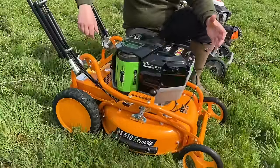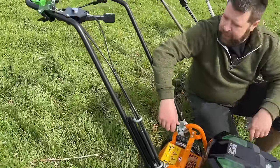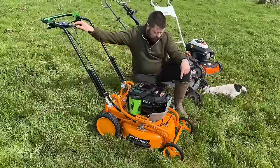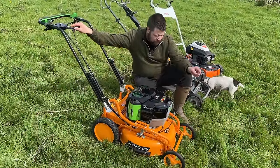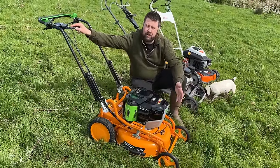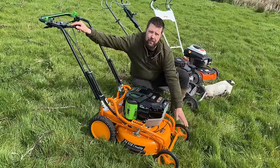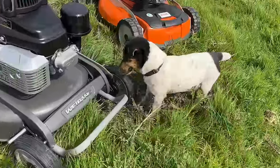The Grin has a very special blade protection system underneath, mounted on a cone with no bearings. It's fully supported so if you hit anything, there's a little bit of movement between the blade boss and the cone itself, so you're not going to damage any bearings. That's their own design and we'll take a look at that later. Now the AS Motor — the AS510E is fitted with the Ego power plant, meaning you can fit two of their batteries under the cover or use the backpack battery.